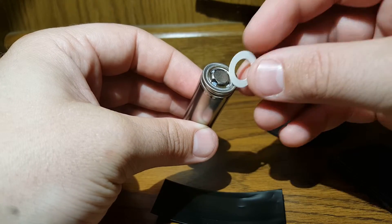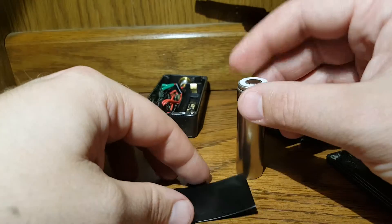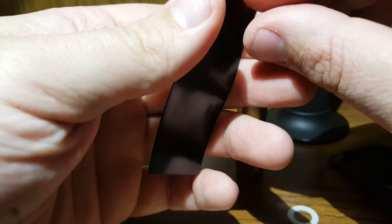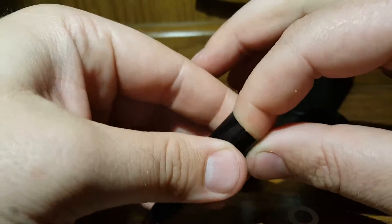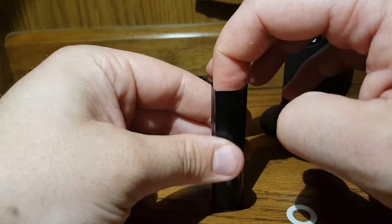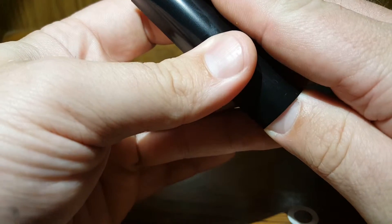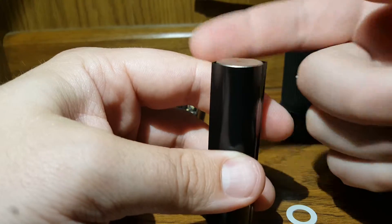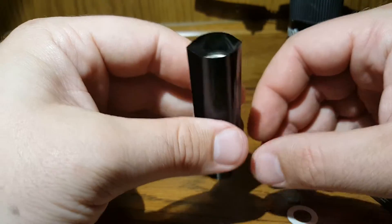You see this little insulator? You want to keep hold of that — I like to keep that on there. Open up the heat shrink, stick the battery in, and lay it flat on the table. The trick is to stop the wrapping just flush, just a tad proud. That way every time you pull it out through the negative side, nothing gets stuck — comes right out. This tends to work great.